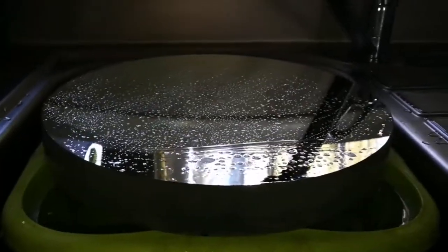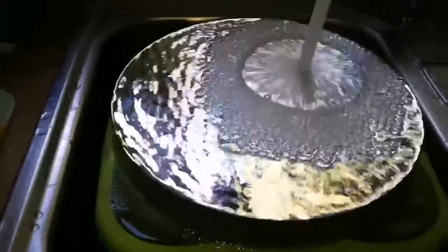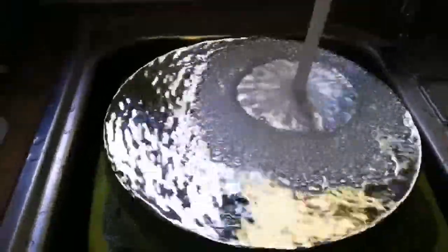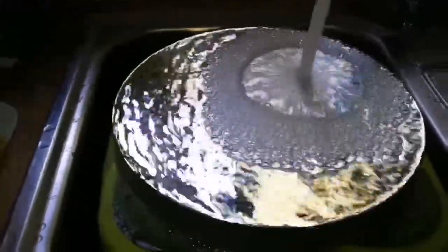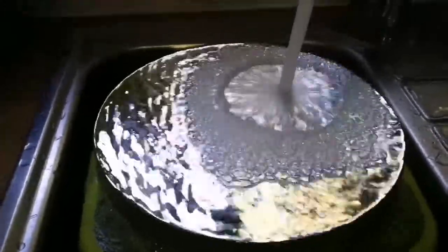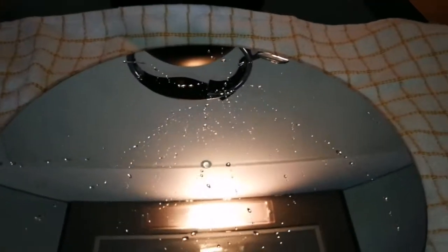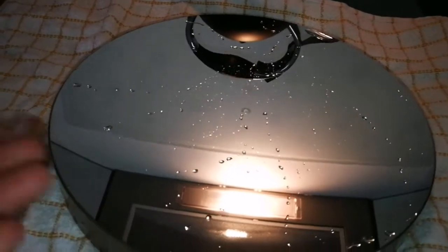The mirror is clean — it took less than 10 minutes. I'm rinsing it with tap water, then I'll use deionized water to remove small droplets. For drying, I use tissue — bend it into a sharp point and absorb the drops one by one. I may also use an air blower to blow away remaining water. The mirror looks really nice and shiny.